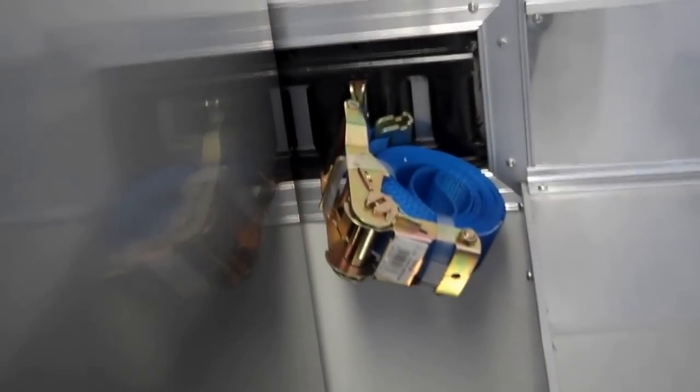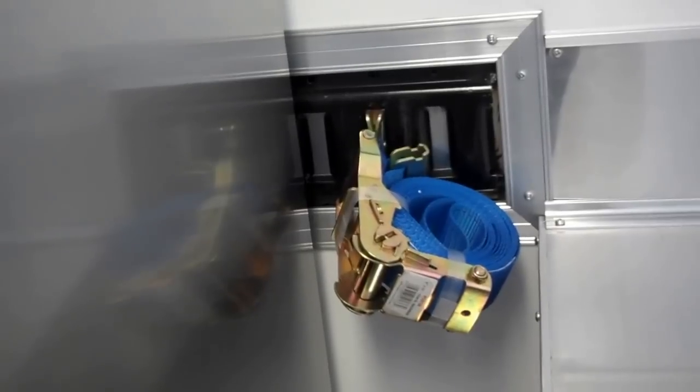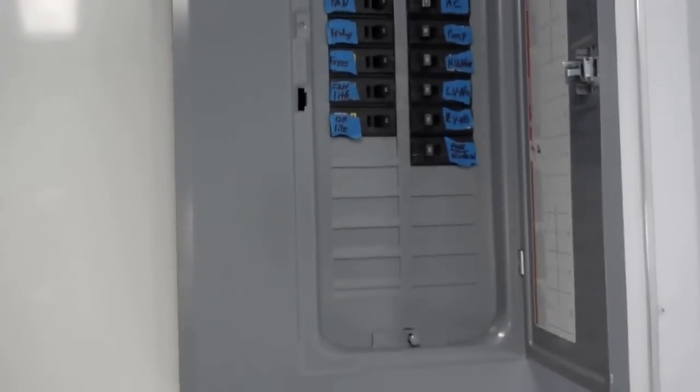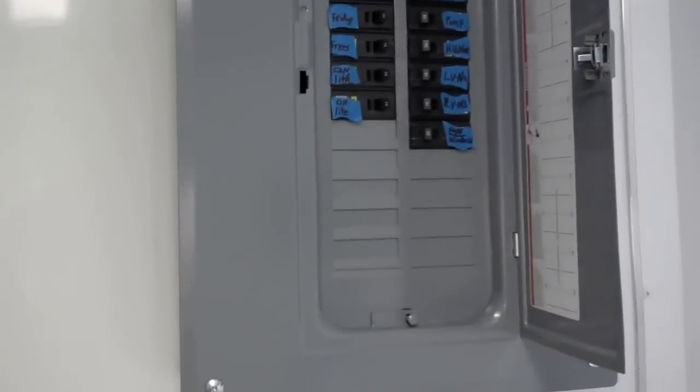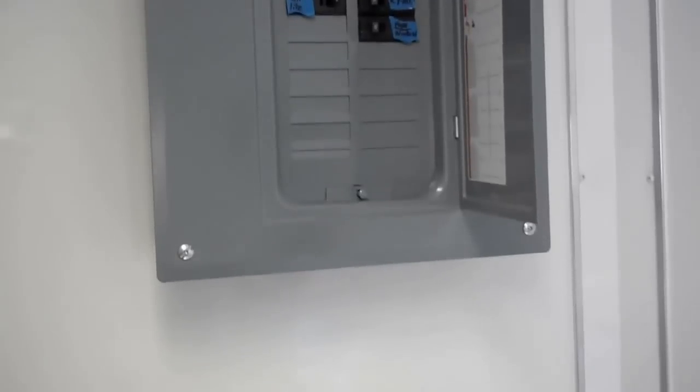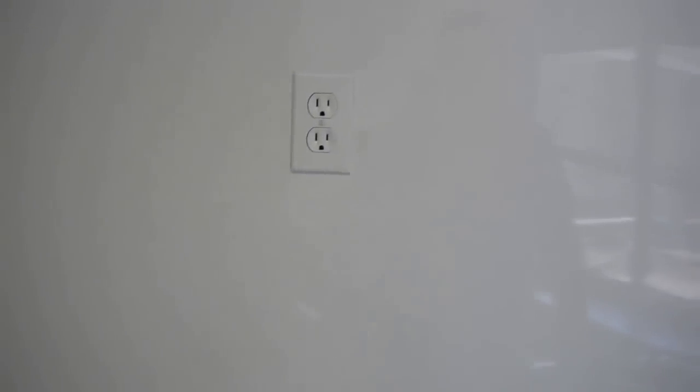During transportation, it has ratchet straps that go around the refrigerator and freezer and tie to the E-strap mounted into the wall. Simple to tie down. Electricity is a 100-amp panel, though it only has 50-amp service. It's 20-space and I'm using 11 of them, with 9 still left. I don't like the idea of running all your receptacles on one breaker — these trailers get equipped with a lot of equipment, so I put them on separate breakers, unlike most builders. This electrical package has over 20 receptacle boxes.